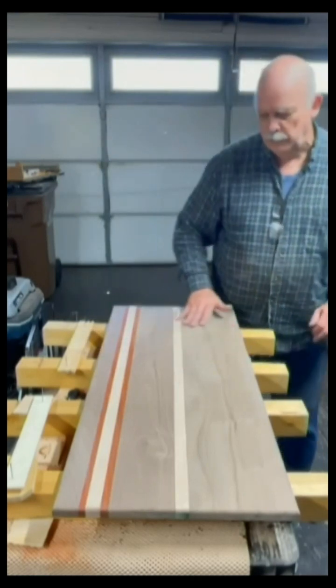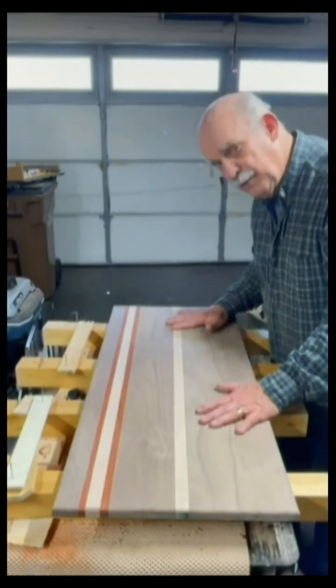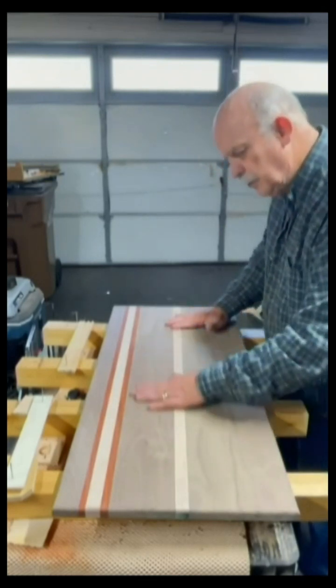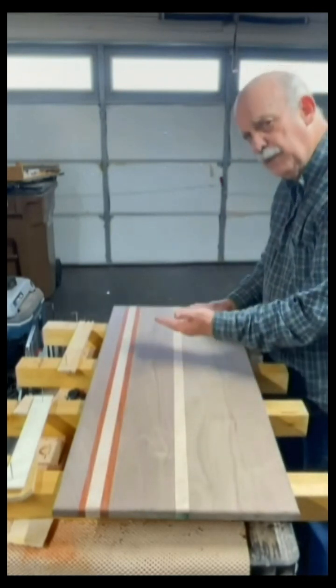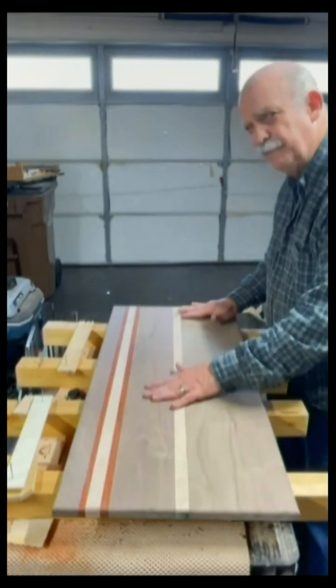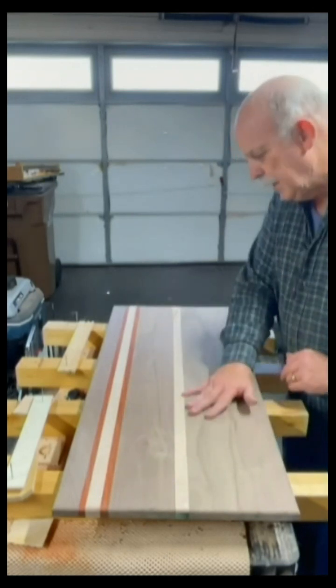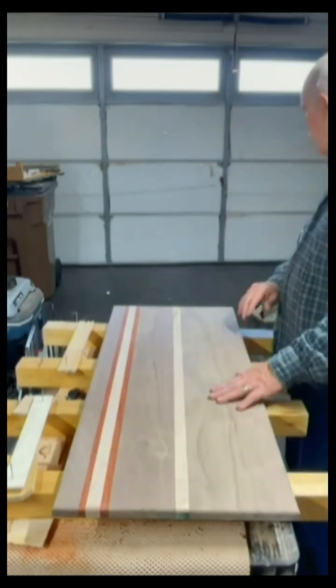Once we got this done I'll be doing some sanding — I love sanding, don't you? Just a real light one because this came out really nice off the planer. I'm going to use a damp cloth and go across it a few times — that helps raise up some grain and you can actually feel where it gets fuzzy. Then you can sand down again to get those high spots and eventually get it nice and smooth, then start putting the finish on it.